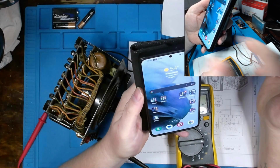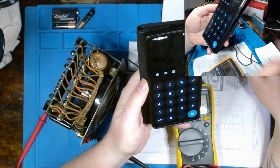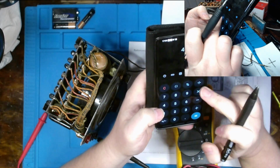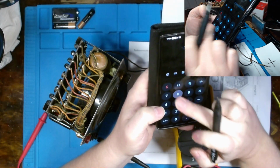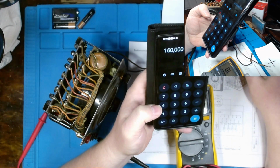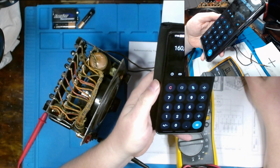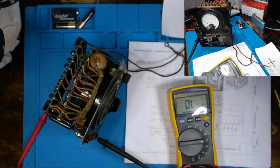Well, essentially we are going to square our voltage, so 400 times 400, and divide it by our resistance. Let's first do that, and then we'll take that number and divide it by 585,000. So in this regard, that resistor could be potentially slightly more than a 1/4 watt, so maybe a 1/2 watt. But that's not the highest voltage on our scale.